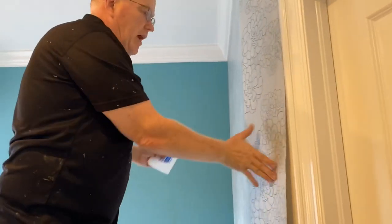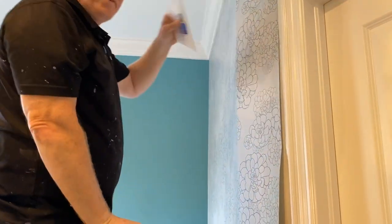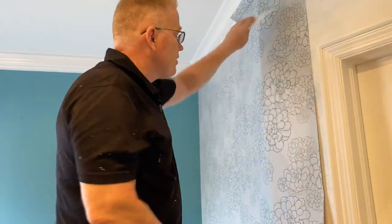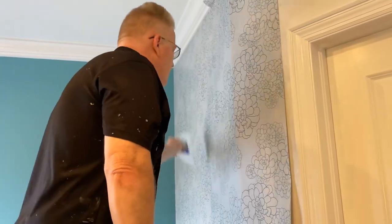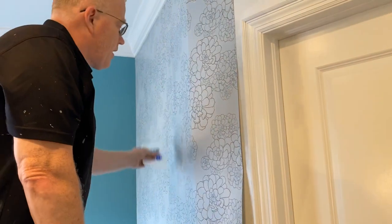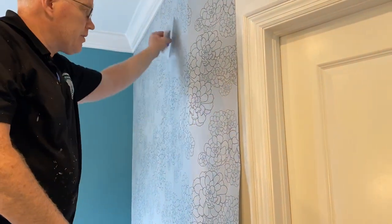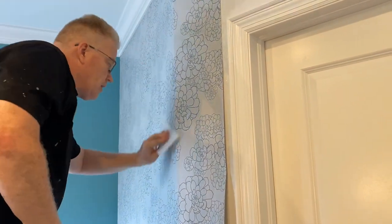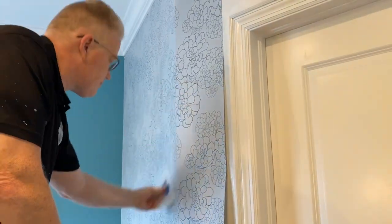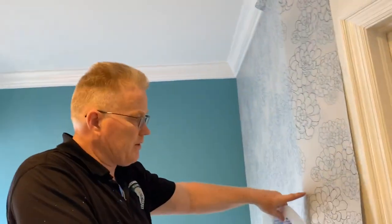Okay, so doing an outside obtuse angle requires a Christmas tree-like sweeping motion with your smoother. So I'm doing this. You want to get that angle down tight. And so there's no doing this. You'll burnish the corner there. You want a sweeping motion, Christmas tree-like. You know the way a Christmas tree lays out like that? You don't want any air obviously getting trapped there.